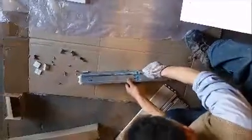So inside the base cabinet, you will find a separate box for the soft closing track for the drawers. All the base cabinets will have pre-drilled holes for the drawers. So the drawer on the back of the track will have this plastic holder. So this plastic holder looks like this. It will go into this hole. Just goes in like that. Give a little pressure and it goes in. And it has 2 holes in each plastic holder. And later 2 screws will go to each side.